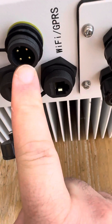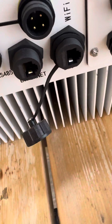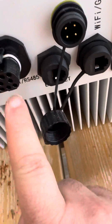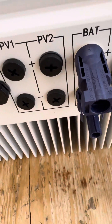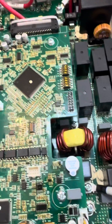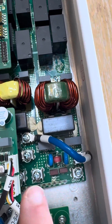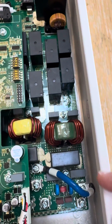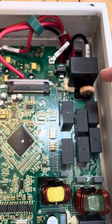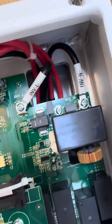There's the Wi-Fi data stick there. This is an older model — a generation one — so it has Ethernet, although that's been disabled on newer firmwares. That's the COM port connection there, and obviously the battery connection. With all these PV inputs being blanked off, the main AC will come in from this side, go to those terminals — they have a plug that connects to that — go through all of this. It looks like it terminates in the thicker wires if you follow them, goes through this capacitor block, but also goes into that module on the back.